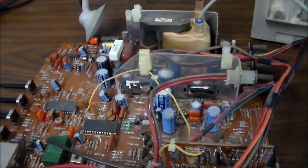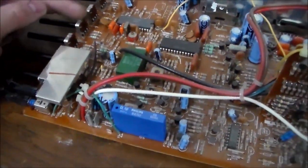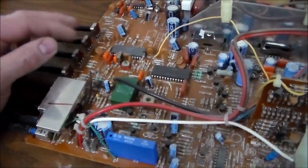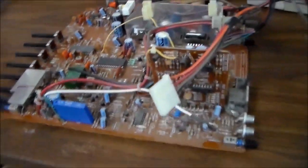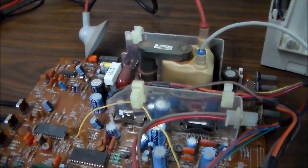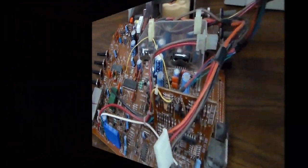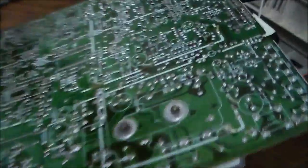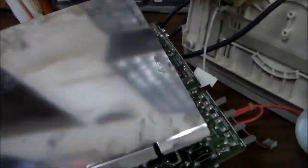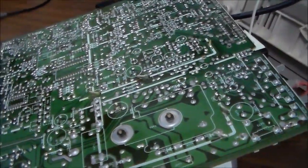Presumably some of those will fix our brightness problem — that's what we're hoping at least. You could even cheat and try to figure out which cap is which by looking at the schematics, or track the brightness and contrast pots back through the circuit. But there are probably problems all over the place, so we're going to replace all of them and put it back together. Here is what the bottom of it looks like after you take this big plate off, which they actually had soldered on there — I guess it's some kind of RF filter that the government probably made them do.